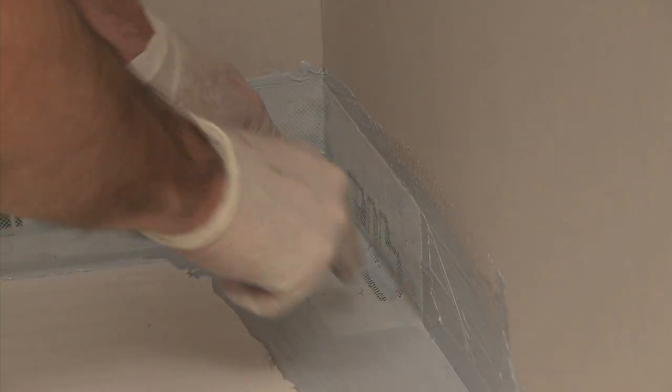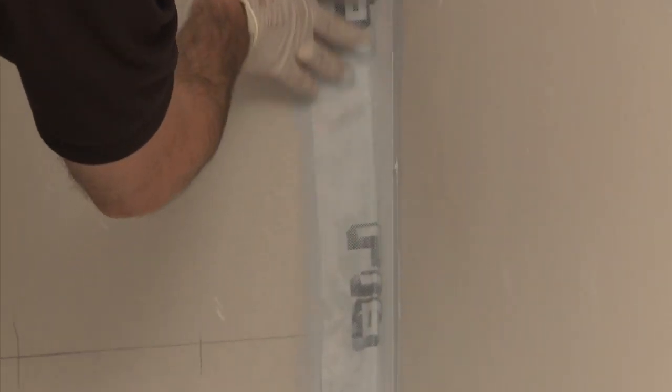Ensure that you use the reinforcement tape on all weak areas, wall and floor joints, around the flanges of the drain and the perimeter of the UniSlope board. It is advisable to cover all screw heads.